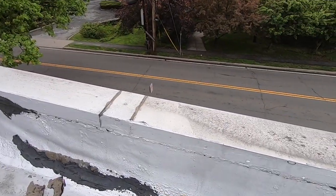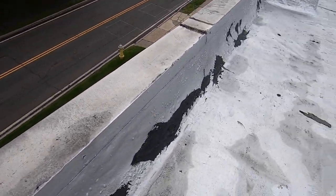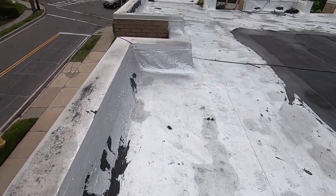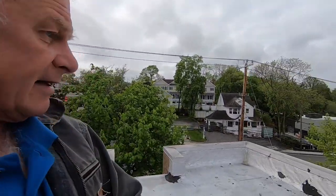Look — there's nothing up the wall here. This is paper, cracking open. They just went to the bottom and that's it. The parapet wall is part of a roof. You cannot stop with a roofing membrane at the bottom of a parapet wall. The parapet wall is part of the roof and that's where most leaks occur — because of the parapet wall and the flashing.